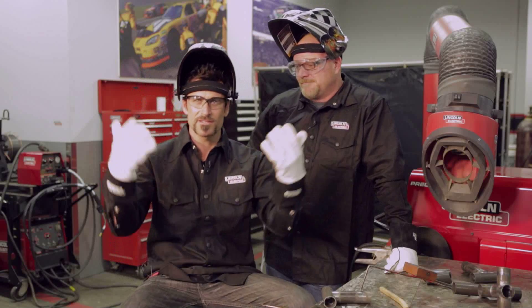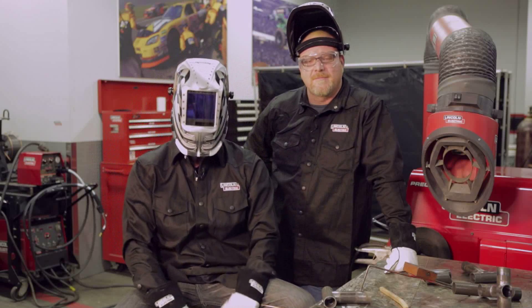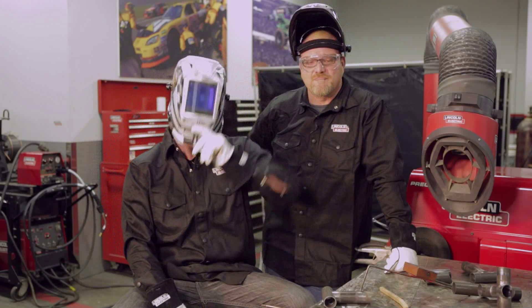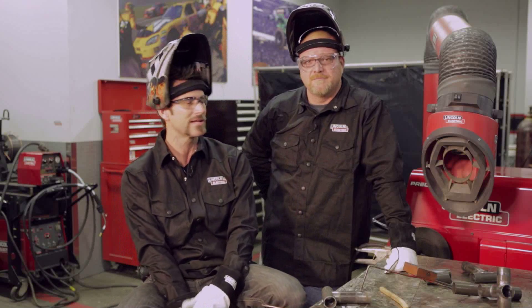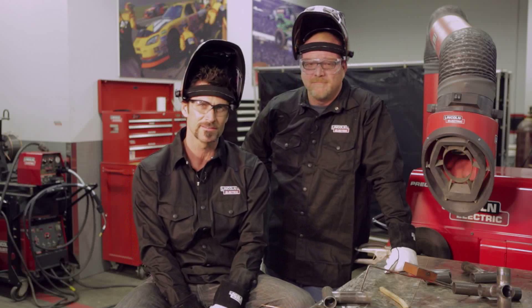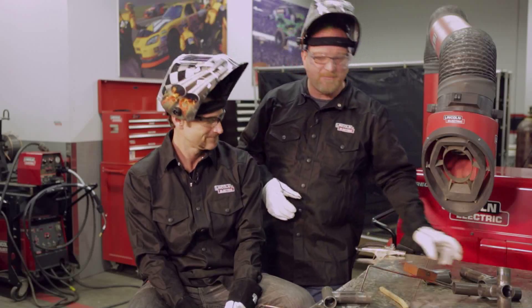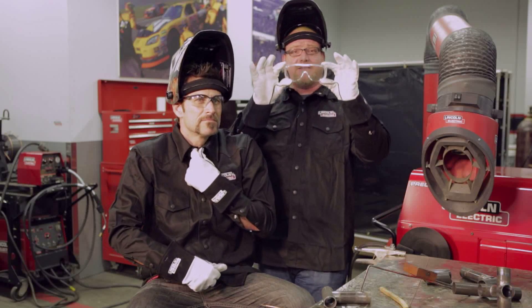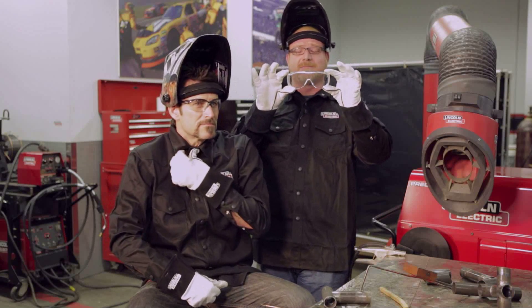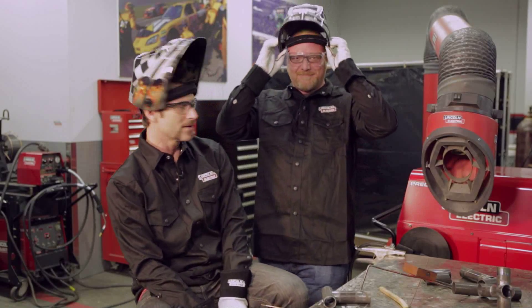Let's start with a little bit of safety. Obviously you don't want to burn your hands, you don't want to burn your eyes. Get your safety glasses on, make sure you're wearing your welding hood. TIG welding is what we're going to do today — we're about 80 to 100 amps on 90-thou material. If you're working at a table with a friend, one of the other things we need to protect ourselves from is the rays. Make sure your coat's buttoned up good, and Z87-rated safety glasses.